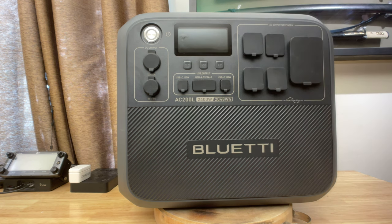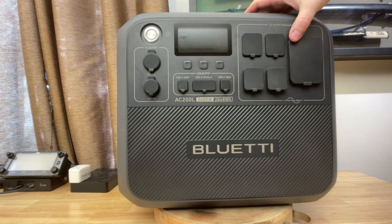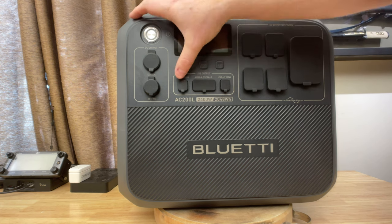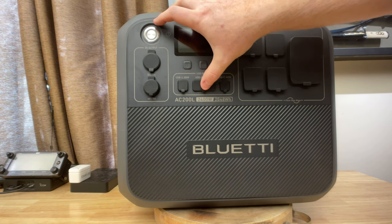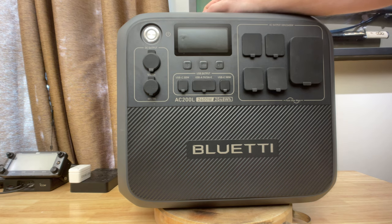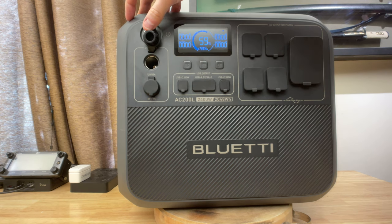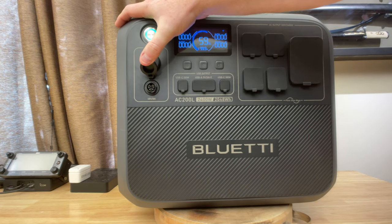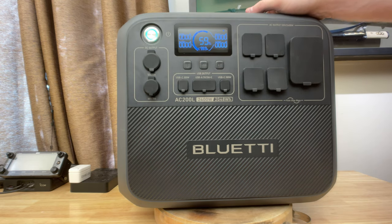You've got a 2,400-watt inverter, so you can't run two of these 20-amp ports at full wattage at the same time, but you can run one of them at full wattage. And you can pull all 2,400 watts at the same time out of this TT30 port. We have the DC side — two USB-C ports labeled 100 watts, a USB-A port 5V 3A (there are two of them). We have the new screen. We've got DC output — that's a cigarette lighter jack. And in lieu of the 30-amp 12-volt port, we now have an 8-amp 48-volt port. I'll be able to do some extremely limited testing on that because the cables for this port aren't available yet.